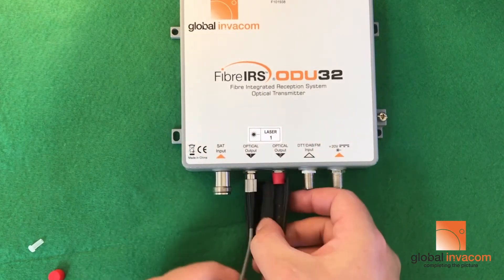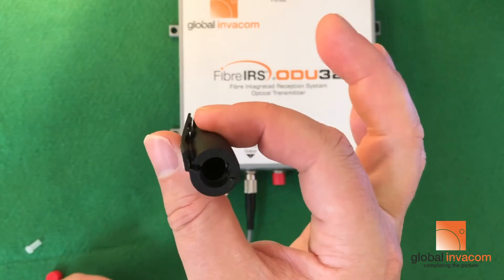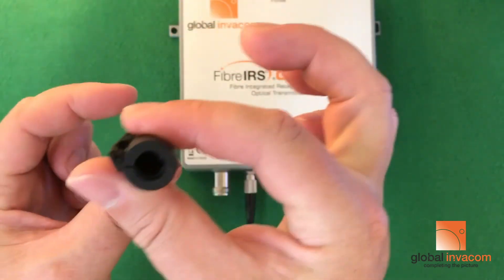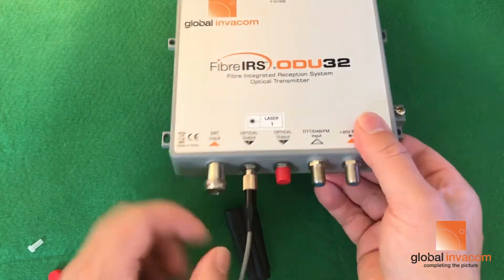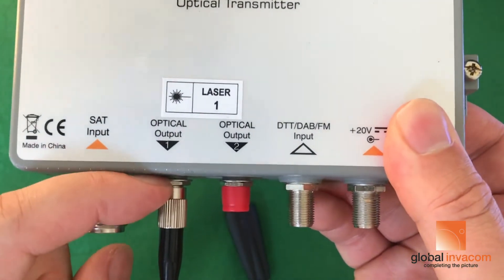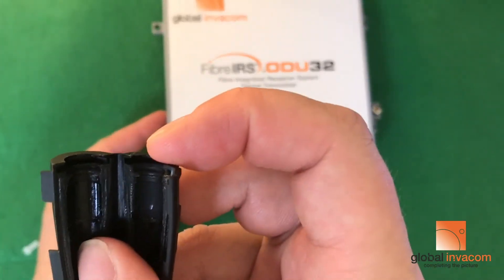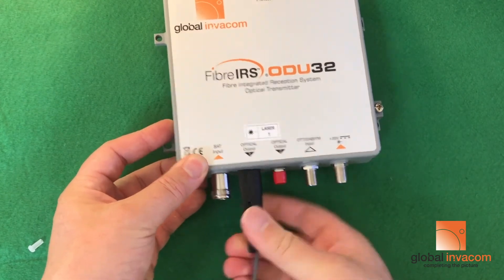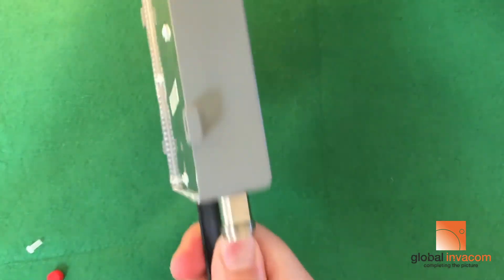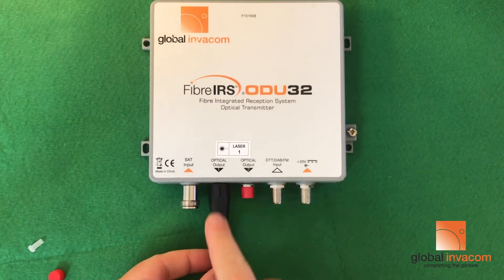The mistake made quite often is to try and fit the two gel boots on separately — they're actually not designed to do that. This is a single unit; it's not just a half, it is an actual single unit that needs to fully close down. It will clamp on, and there's also a little light washer that's offset from the housing, designed for the lip on the gel boot to click around and then just click together, ensuring a good tight fit.